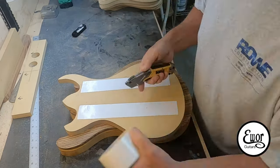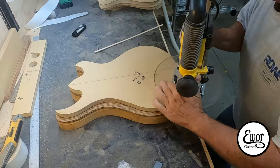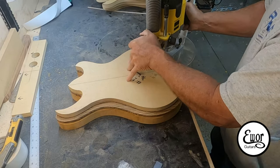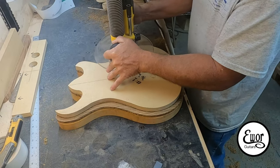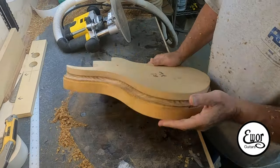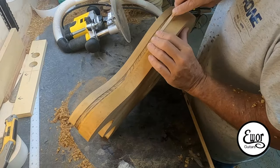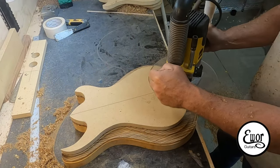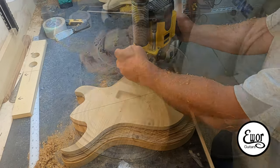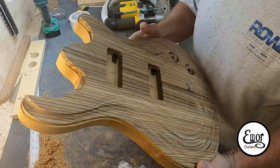Here are my body shaping templates. Each one is a little bit smaller than the one before. I'm setting the depth so the first cut will sit right on top of where my binding is going to go, using that same three-quarter inch bowl bit. The first pass is three-eighths of an inch deep, and each successive pass I raise it slightly to achieve the ultimate carve in the top of the guitar, which I'll then eventually grind out with sanders.